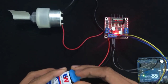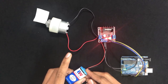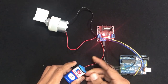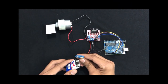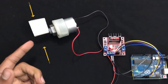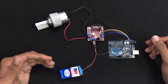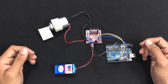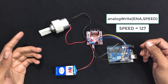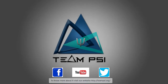This short video I'm showing is not mine — I'm crediting Team PSI, which is a great YouTube channel. It's just to give a visual of how we're using the trains as motors. He shows how you can change the positive and negative to make the motor rotate clockwise and then counterclockwise, just by swapping the high and low outputs in the code — a very simple code where one output is high and the other is low, then vice versa.